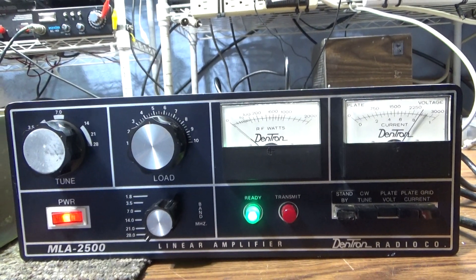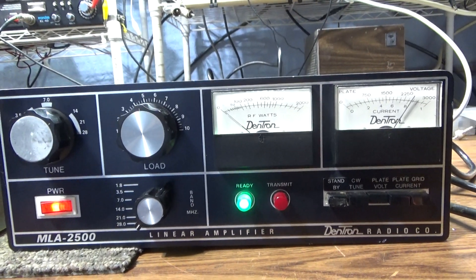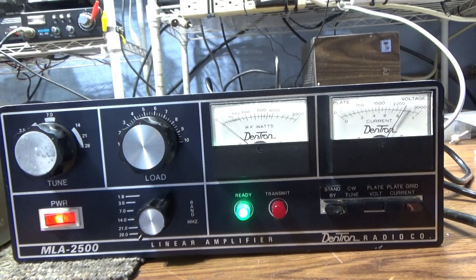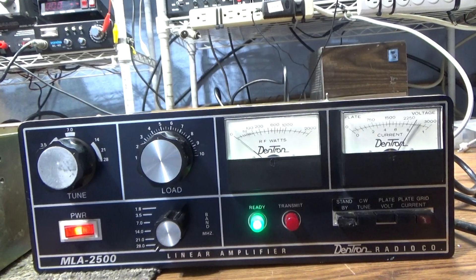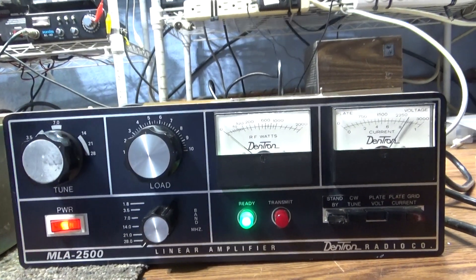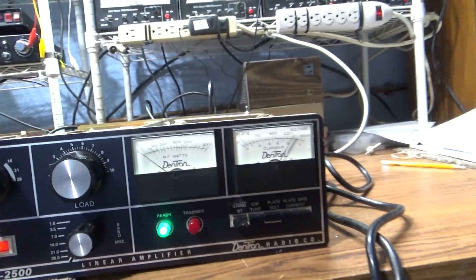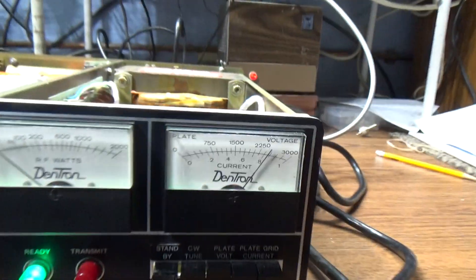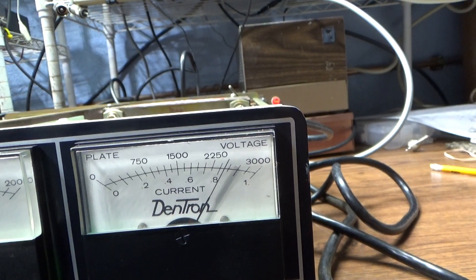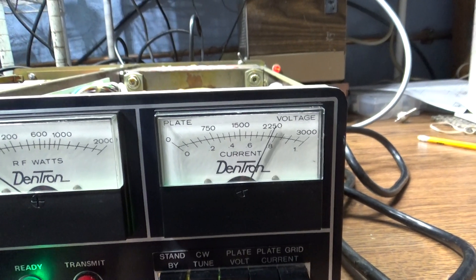It's not the greatest soft start, but it does limit some of the surge by being on the low tap first. So if you're running an amp with a high/low switch and it doesn't have soft start, I'd recommend starting it on low, waiting for everything to warm up, then switching to high. That's better for the amplifier and it'll last longer. On high this runs about 2300 volts; switching back to low, it drains back down to about 1800 volts.